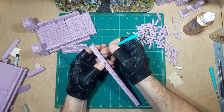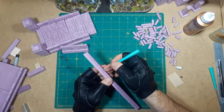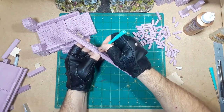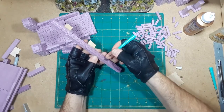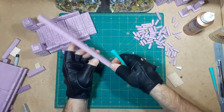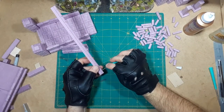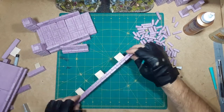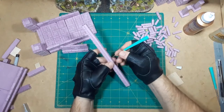Nice worn brick. How cool is that? You make these as shallow or as deep as you want. You can cause more rip outs if you want. This diamond tool works better on these little ledges, like just to real lightly just pull out. If you pull too hard, it will rip real easily. And I'm just going to bring this brick line to here, which is just another center on these.